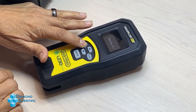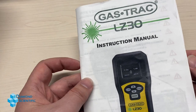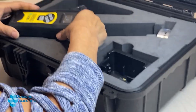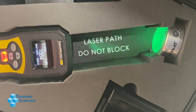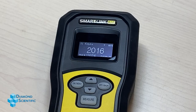Once it's finished warming up, we're going to perform what's known as a bump test, though it doesn't actually require bumping the device at all. Place the active LZ30 back in the case and hit the measure button. The case is specifically designed for this test, taking a reading from the calibration cell a few inches away. You should return a reading of at least 1500. Once you do, the unit is ready to start doing its job.